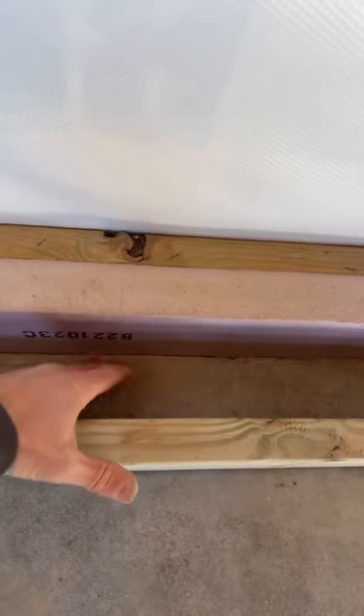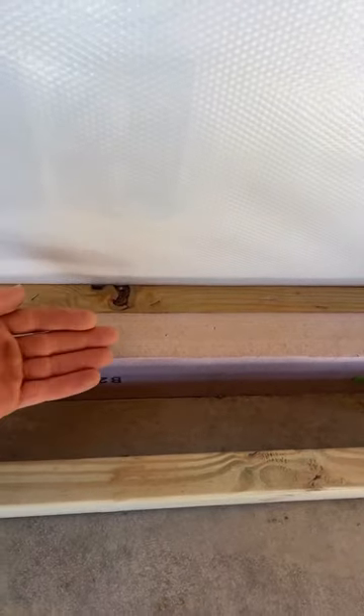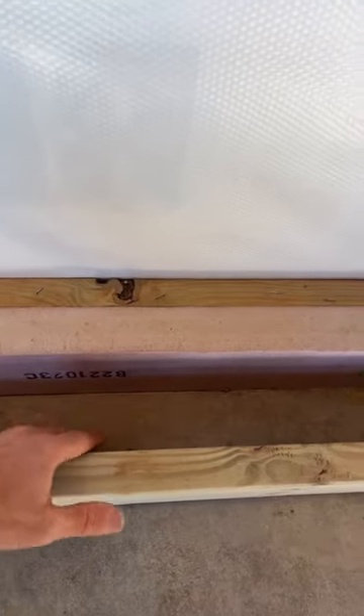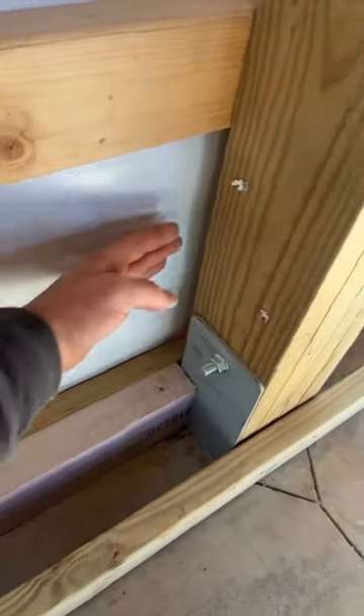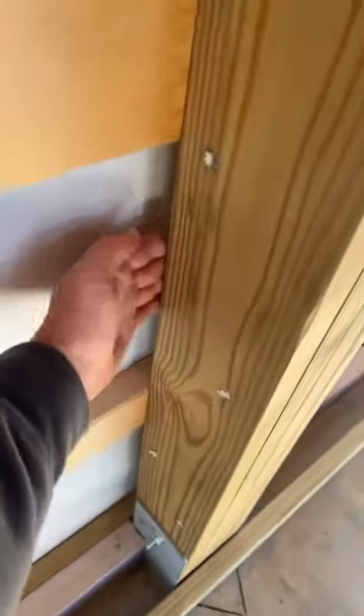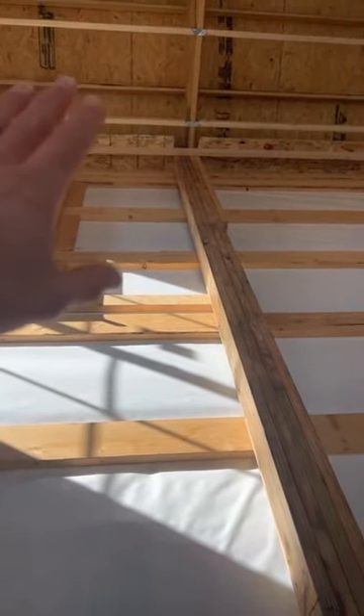He will fill this bottom cavity, attaching it to our insulation that goes down two feet and then under the slab. This will get filled — it'll come up over this, come through here, fill all the voids in between the girts and behind the columns. Then it'll go all the way up and he'll fill that cavity up there, isolating our wall cavity from our unconditioned attic space.